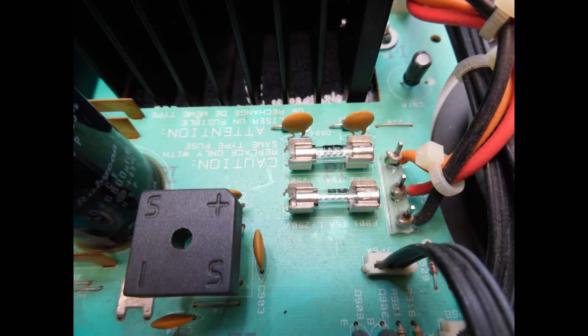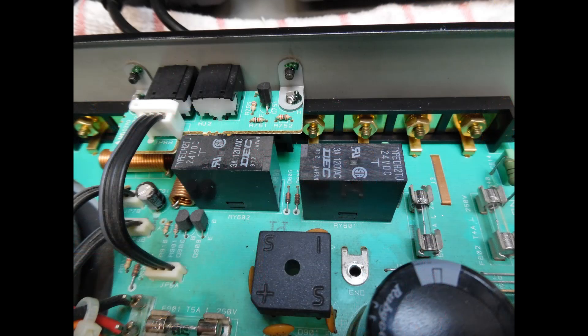What I'm showing you next are the power supply fuses — this is what Martin found. He found that these fuses had blown. These are T5 amp time-delay 5-amp fuses and these were replaced. The next thing I'm showing you are the speaker protection relays.